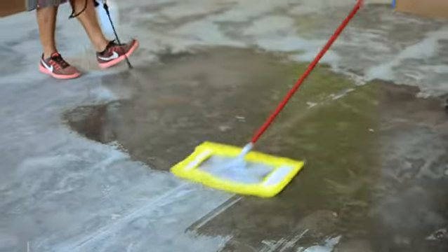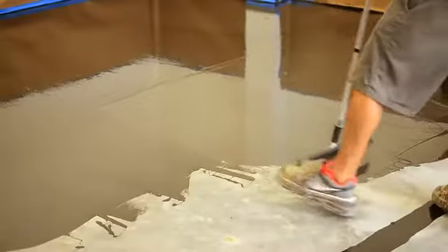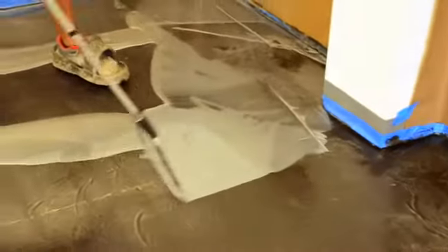We prepped the floors — they've been ground, we've taped everything off, and we're going to be putting down the base coat. The reason we put a base coat in a dark color is because metallic epoxy is very transparent and translucent. If you have a dark base coat, you can get some really nice shadowing to where it almost looks like two or three colors, a lot of depth and movement — all with one single color. We're going with a medium to dark gray. The next day we come back, put the metallic epoxy coat, then the protectant sealer so it keeps looking nice for years to come.